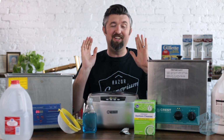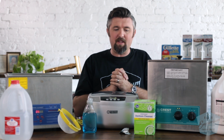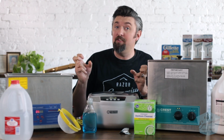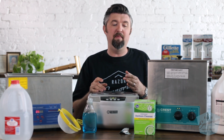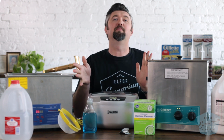Again, I'm not going to teach you high school chemistry class, but in short, a solvent is something that is going to help break down oils and grease and grime and kind of break that apart. And then you have a surfactant, that's a wetting agent, and that's something that's going to basically lubricate your water, if you want to say it that way, and make oil or grease or grime or soap scum want to come off your part.